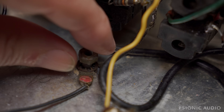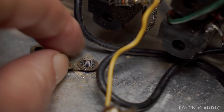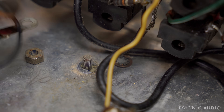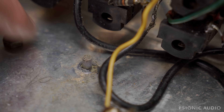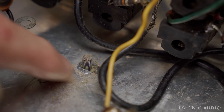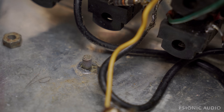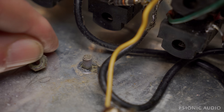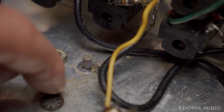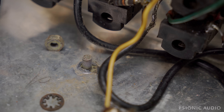There will also be exciting things like disconnecting a chassis ground connection — in this case for the output transformer ground — and cleaning up all the connections, because see all that dirt in there? That was between the various metals, and all the metals are tarnished. By cleaning all this and putting it back together with good metal-to-metal contact and no dirt, we'll actually have really good grounds and the noise floor will drop.